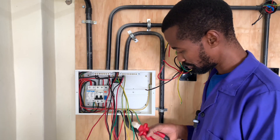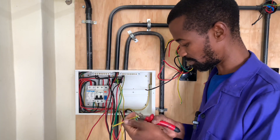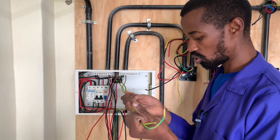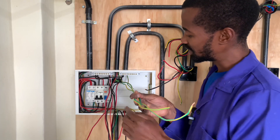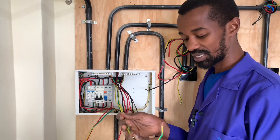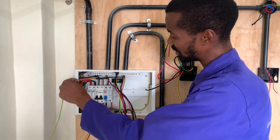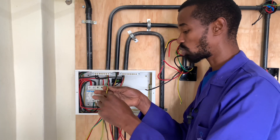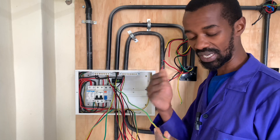I will simply strip them, and I'm starting with these other ones that are coming from the conduits that are above here. Notice how long these wires are and I have to connect them here. I see many people — most electricians — make this mistake with the earth connection: once they measure that they have to connect it here, they cut at the exact position. It is important to have a lot of space for future repairs in case there will be need for more wires here.